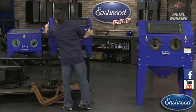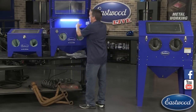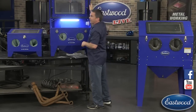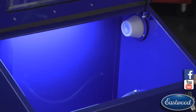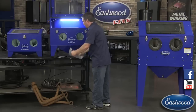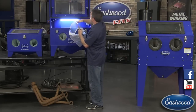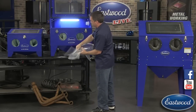The modular one has a really bright LED light and it has gas struts which hold the lid open, as opposed to the other ones that just have latches. You can really see when you're in there blasting. These are all top-loading with replaceable liners - when these get all marked up you just peel them off, put another liner on, and you're back to being able to see really well.